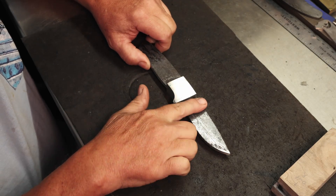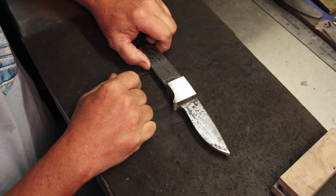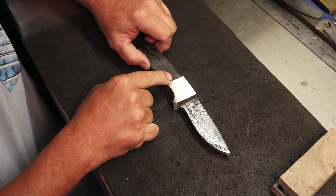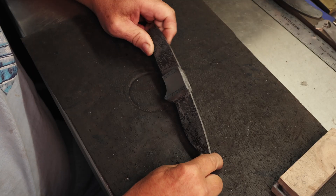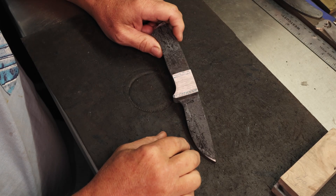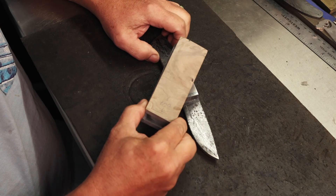What I'm going to do now is come in here and cut the scallop, blend this blade with the bolster, and also square up the back end. I'll be cutting and milling it out. We've got to do a little tapering here, a little distal taper there. A lot of work. Get ready to heat treat and get the handle material on there.